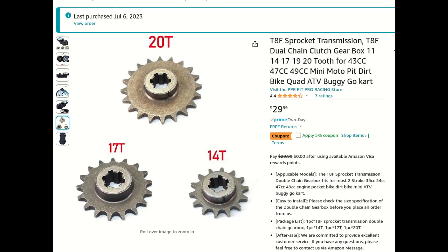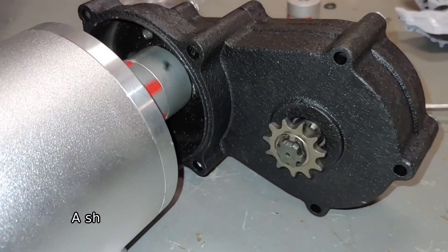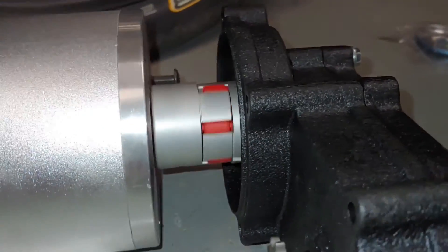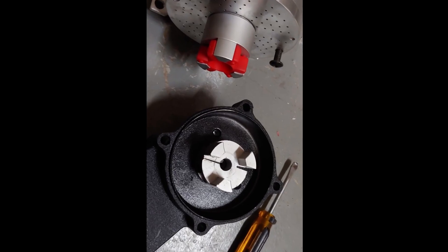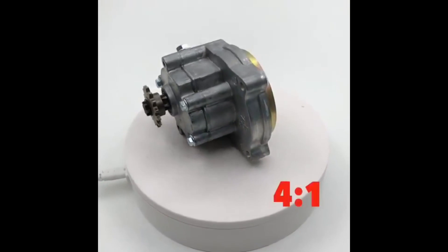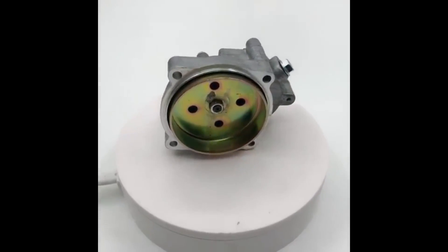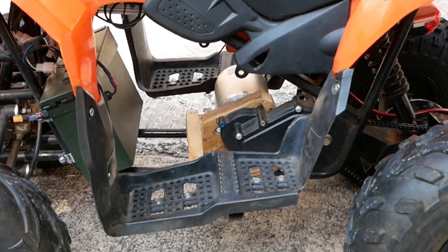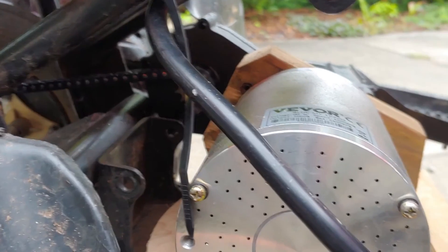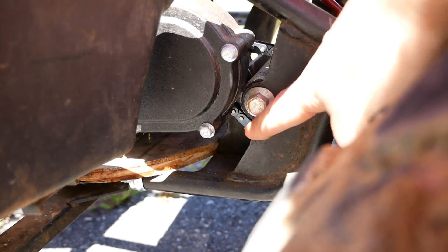The gearbox gives me about 3.3 to 1, which multiplies my earlier 7 to 1 to get me right about where I need to be. Since this is only a prototype, I used a shaft coupler to connect the motor to the transmission. The transmission shaft turned out to be a non-standard size, so I modified the coupler to fit a smaller diameter, and this introduced some shaft wobble. If I had to do it over, I'd try to find the right coupler size, and also use one of these chain-free transmissions with a slightly larger gear ratio. I'd also plan to replace the wooden motor mount with metal once it broke, but it has held up surprisingly well. One of the reasons it has lasted this long is that the transmission casing is resting against the frame, so it cannot move under load.